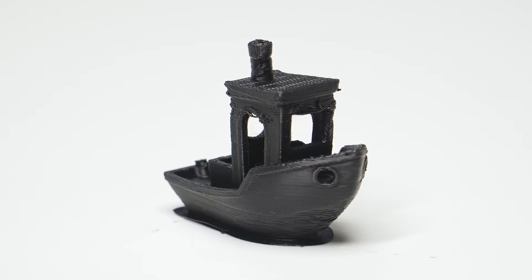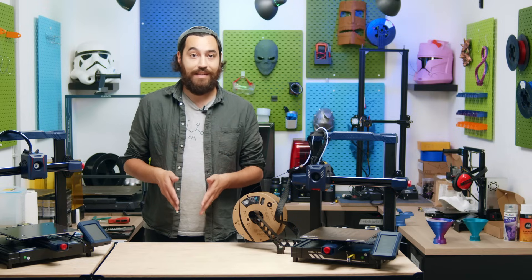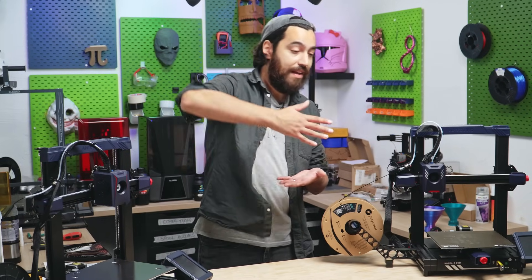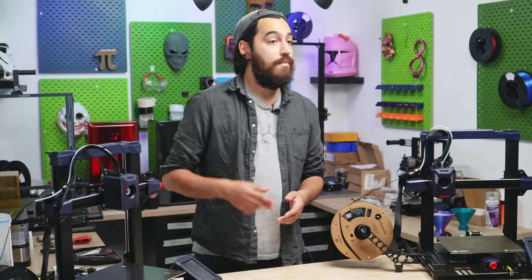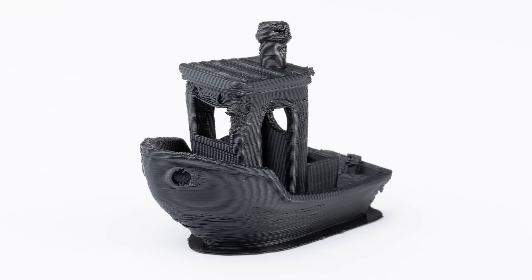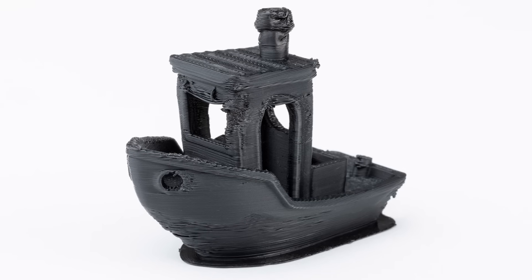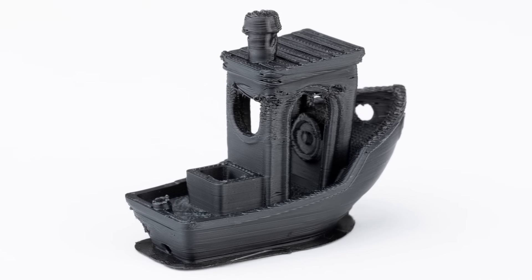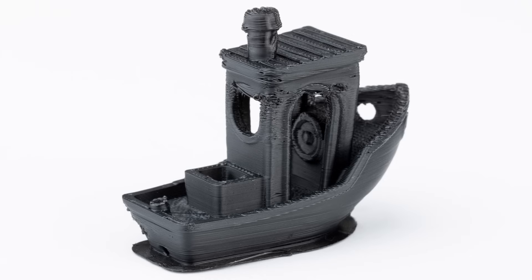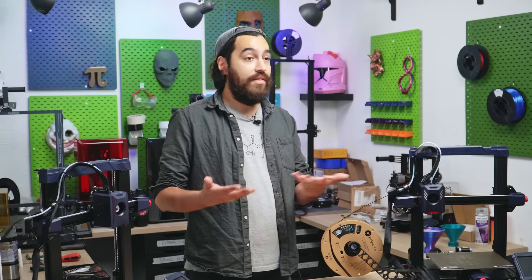This is where high acceleration kicks you in the teeth. The first layer is fine, but then we hit the overhangs. Overhangs are quality killers when it comes to high speed and acceleration — as the filament is not extruded on the underlying layer, it's at an angle, so it wobbles a bit, which means you need excellent cooling to solidify it as quickly as possible before the next layer comes around. Moving up past the steep overhangs, quality is good, but then we get to the bridge. Bridges have zero support, so again you need to go slow or have awesome cooling. The printed part at this height is also tiny in area, so we're only spending seconds on each layer, giving them less cooling time, and we get the inevitable waviness. The main problem is cooling — most PLA is just difficult to cool.